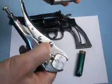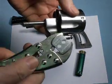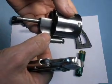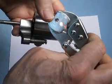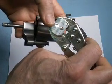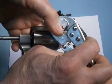We take the tool, depending on the size of the particular revolver you're working on. In this case we're working on a cylinder from a Smith and Wesson N frame, and you'll notice there are two different size holes in the tool. In the Smith and Wesson tool here in my hand, the largest hole is for the K, L and N frame and the smaller hole back here is for the J frame guns.